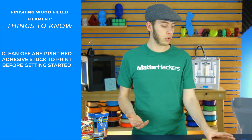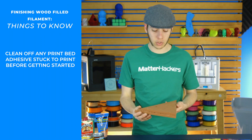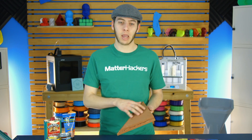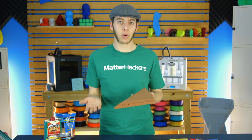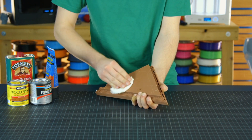We're mostly limited to whatever we can fit on the build plate and sand from there. So the first tip is: before you do any sort of finishing work on your printed part, take it and clean off whatever adhesive you used on your bed surface. In this case it's PLA-based and I used PVA glue stick on glass. So the bottom's a little sticky, and the residue will form basically a protective shield against any of the stains I might use. So I'll want to take just a wet paper towel, rub it down, and get rid of any of that PVA — really make sure that it's clean.